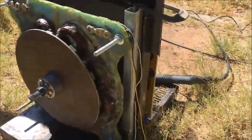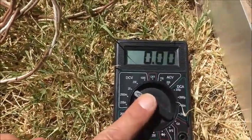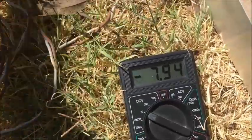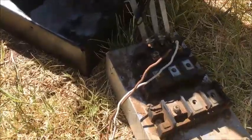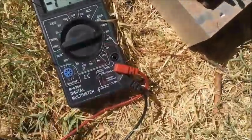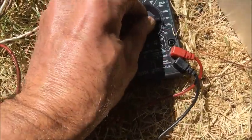Today we're going to test out the turbine and the generator by hand. I've got it connected to the bridge rectifier I found in my junk pile — it's pretty heavy duty, converting it to DC, here around the 20 volt range. Just for a hand spin we're delivering nearly eight volts at that speed, not very fast, and for a short circuit — milliamps — put on the 20.